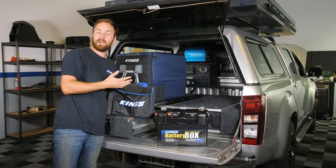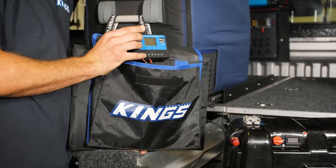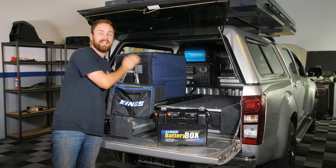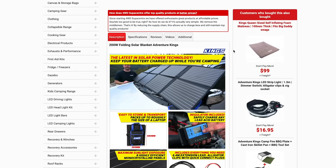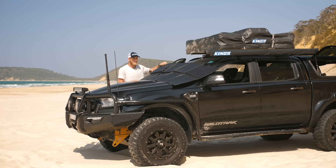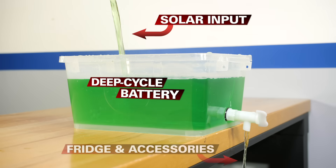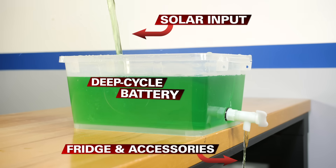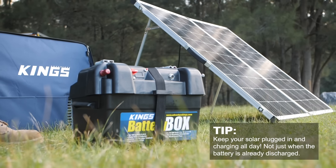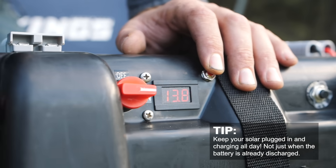A great way to keep your battery charged while you're out for the day or at camp is with a portable solar kit, whether it's a blanket or a folding panel. So long as it comes with a regulator, it's safe to keep plugged in and charging all day, and it means that your battery will be charged and your gear will be running properly. When shopping for a solar panel, check the specs to see how many amps it can put out — look for current at P-Max, not short circuit current. For example, this 200 watt solar blanket can produce 10.48 amps at P-Max. If you had a 100 amp hour battery that was discharged to 50%, it'd still take a minimum of five hours in ideal conditions charging at 10 amps to bring it right back up to full charge. And if you're running a fridge or accessories drawing power at the same time, it'll take longer. So rather than waiting for the battery to discharge, you should leave the solar connected as often as possible — as long as the sun is shining, it'll keep it topped up and it shouldn't ever drop down to such a low level that it'll take hours to charge back up.